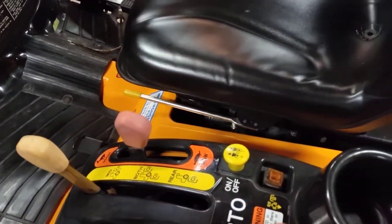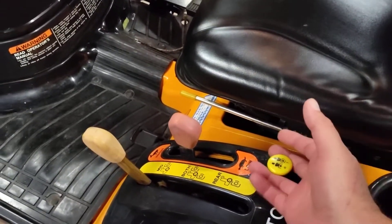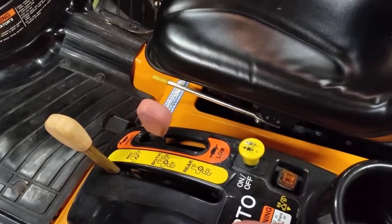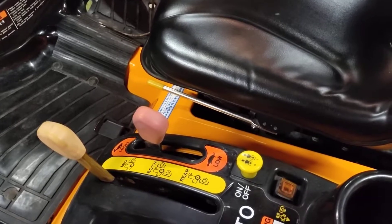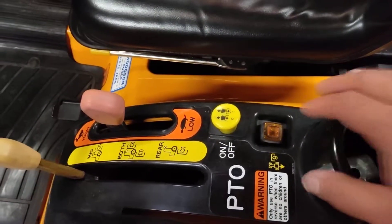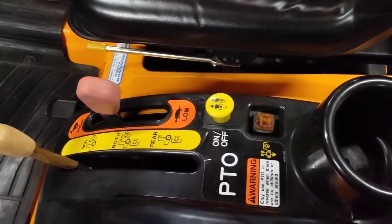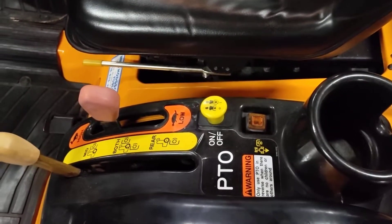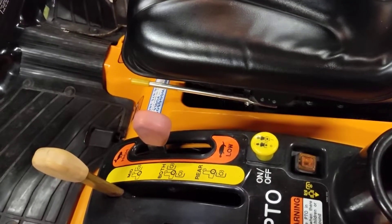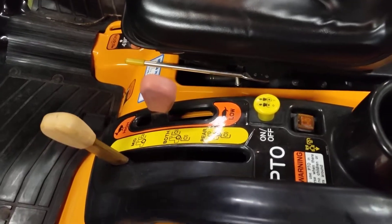Same with the electric PTO — Kubota just does it with a lever and hydraulic operation, but I believe this is electric over hydraulic. That's very familiar to anyone who's ever operated a lawn tractor — just on and off. It's got what I call the lawyer switch, meaning if you want to mow in reverse, you've got to press that switch. Press it once and it's good until you turn the tractor off. But if you don't press it, it's going to stop the deck at full speed, and I don't like that. I engage and disengage the PTO at about 2,000 RPM and then throttle up from there to try to save my clutch.